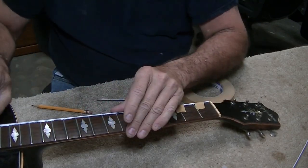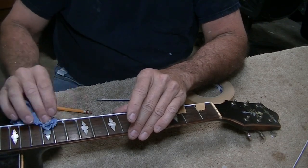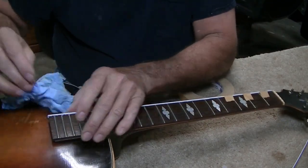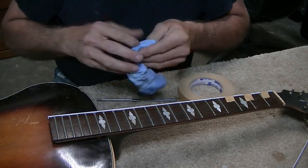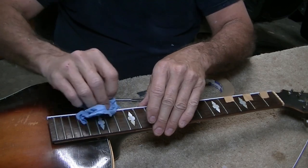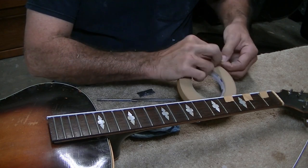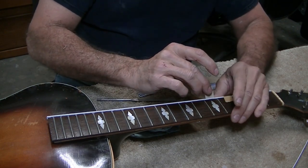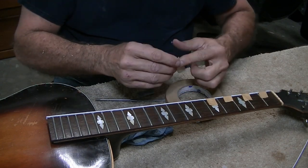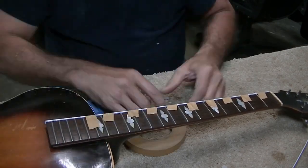The one advantage that the other glue does have is that it does melt the plastic. So like when you get to a corner like this corner up here, even if the joint's not perfect, they'll melt together. With this one, you're going to have to cut a more perfect joint, even though I tried to cut them perfect anyway, so it's not that big of a disadvantage, but that was an advantage that the other glue had, that it worked with an imperfect joint. As I mentioned, it doesn't melt the PVC as well as it melted the other plastics, so it's a point counterpoint.